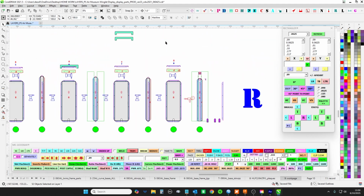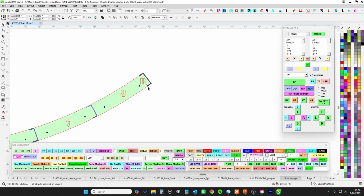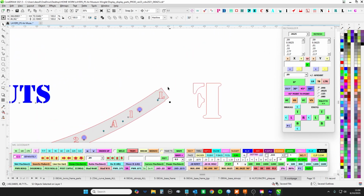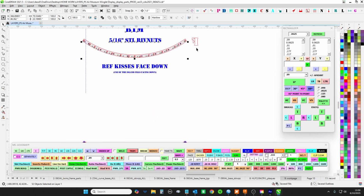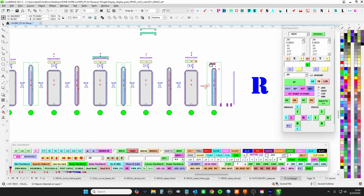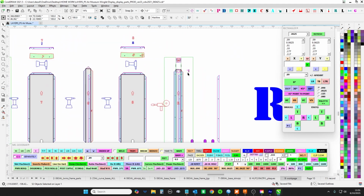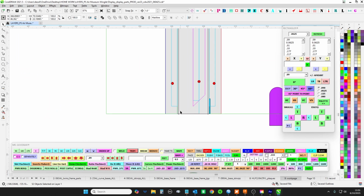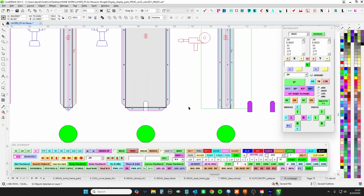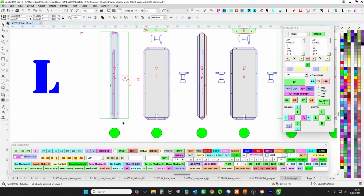Then you'll see that you're ready to cleco, not rivet, your end caps on. So you can see where the end caps are ready to burn in. I have space for that. So that'll tuck in there to that 1/4 inch. And then once you get that on there, don't worry about the top yet. You're just getting these on. You're going to go ahead and tack these guys on, because obviously we can't have rivets on the outside. So you're going to tack your ends on, and then that'll allow you to tack the 1/4 inch in at the base. And then once these are all clecoed, and you have this side on too, tack that in.